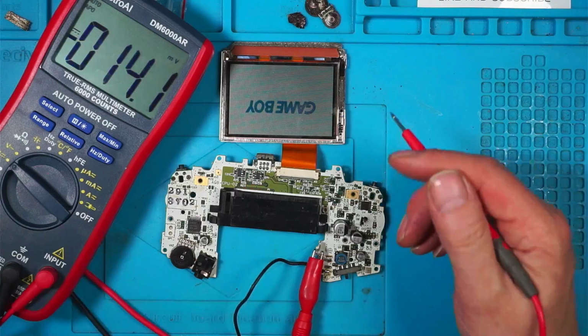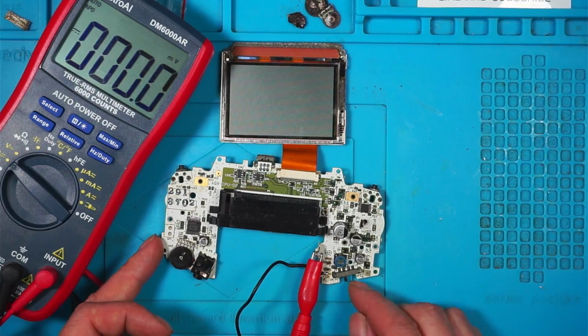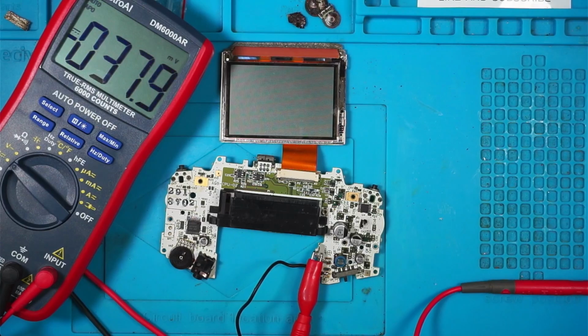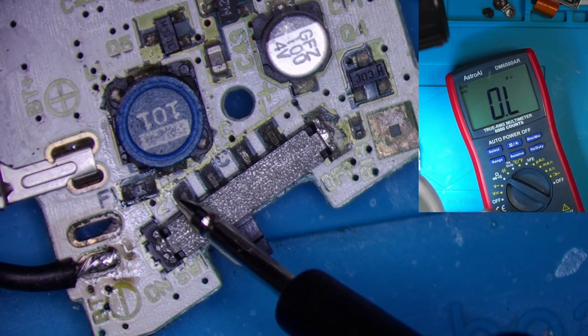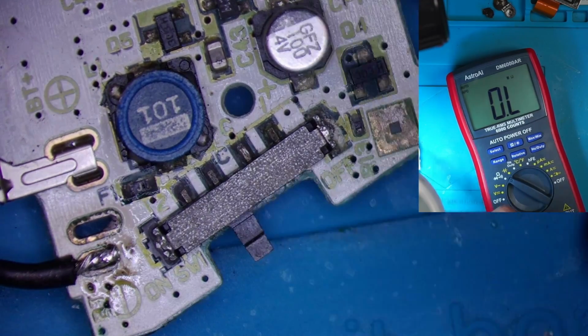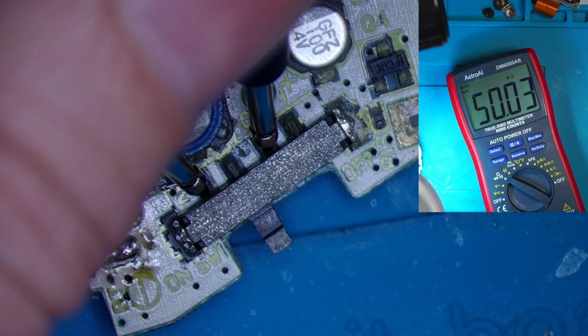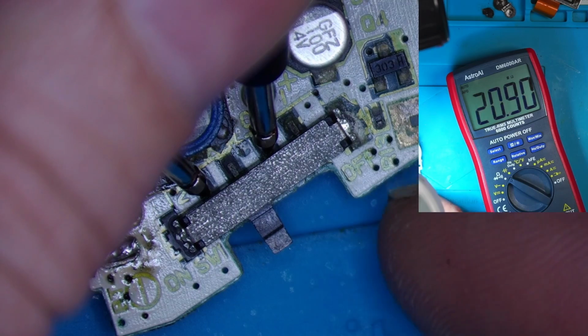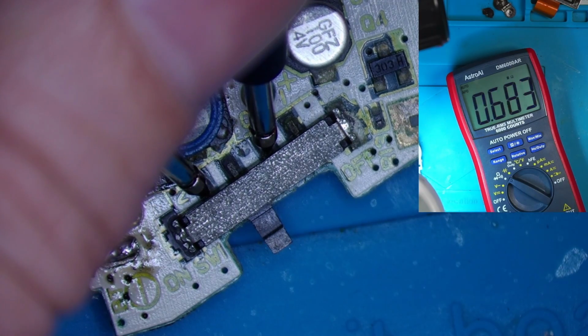I think it's that switch. Oh, it's on again now. I just touch the switch with my nail. Goes off. I'm sure I've got some switches somewhere. I wonder if I can test the switch by testing the resistance. Pin 2 and C should be connected together. Open. So it's OL, and when you turn it on, it should go straight through. As you can see, it's having some trouble.